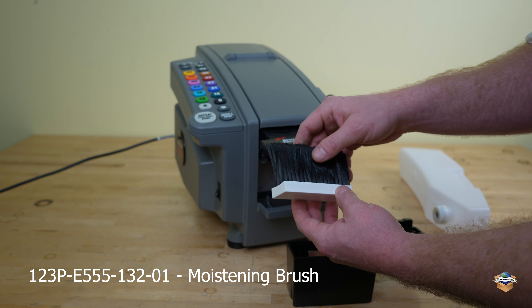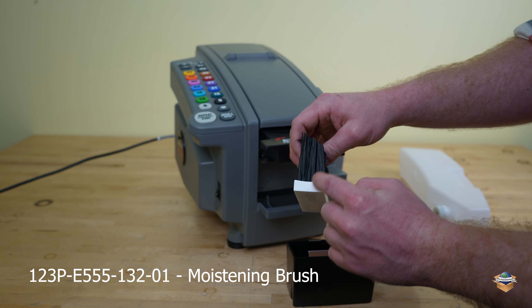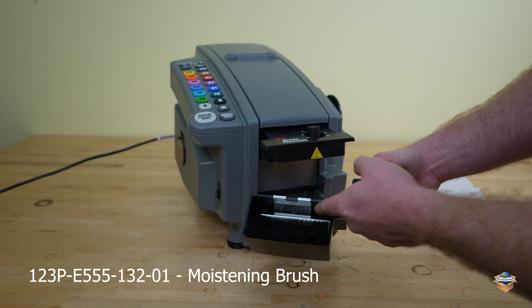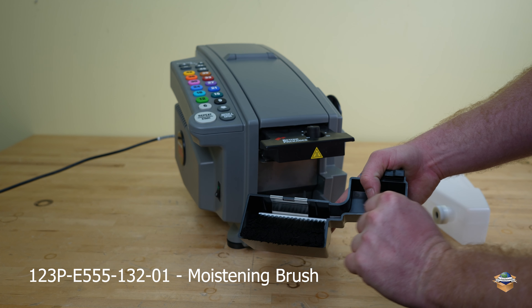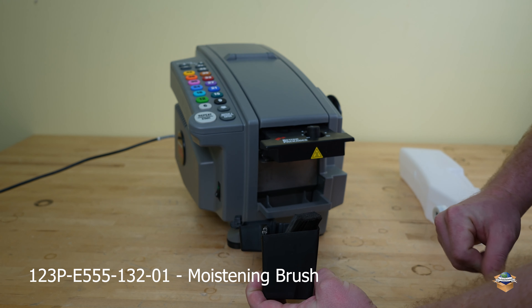BetterPack redesigned their moistening brushes in 2022 around that time. They used to have three rows of brushes and a pen that would come right here and go under this metal plate, kind of like that. But these new style brushes don't sit in the tank properly when you do that. These new style brushes just sort of press in like that — you're not putting that lip under this metal tab. This metal tab is just pressing those brushes in place, and then you'll have a good surface to moisten the tape.